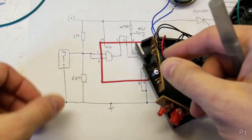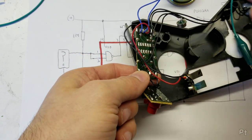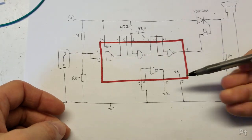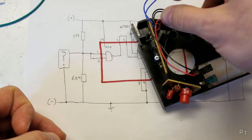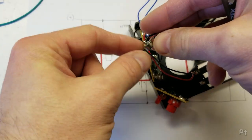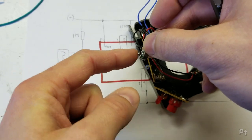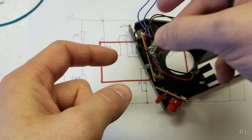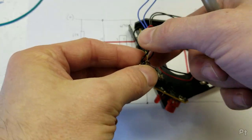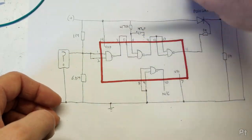This little thing that looks like a transistor: when I put the multimeter across these two, I see a floating voltage of around seven, seven and a half volts. When I shake it, it goes down to zero. So this grounds — this basically shorts when you shake it. That's your motion detection. I've put it as a question mark because I have no idea what it is. Someone please tell me what that is.